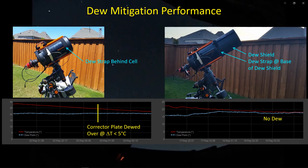A couple of nights ago, I had very good weather, no wind, so I felt okay using the dew shield. As you can see here, I've got the dew shield mounted at the end of the SCT with the dew strap wrapped around that base, just outside the bottom and top rails on the SCT. So it's wrapped around, even helping to hold the dew shield on. The dew shield is fairly tight around the end of the SCT and there's no danger of it falling off. One thing to note is that the 33-inch long dew strap wraps around and the heated element is in full contact with the OTA body all the way around. But over here with the larger diameter of the dew shield, that same 33-inch strap leaves probably about four inches where there is no heating element in contact with the dew shield. So there is a little bit of inefficiency when you wrap the dew strap around the dew shield.